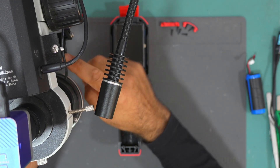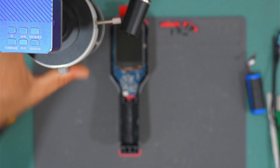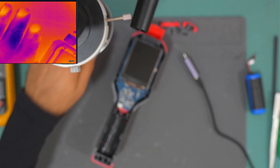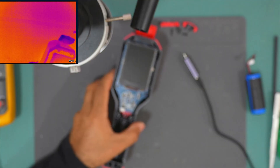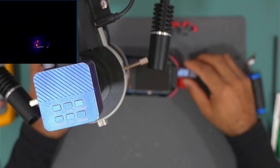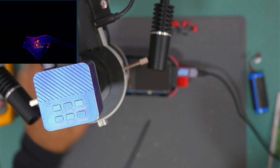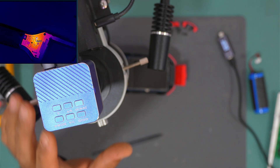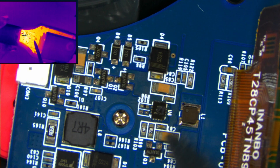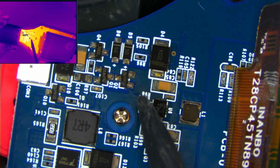I don't know if we can feel the heating component, but fortunately I have another camera mounted on my microscope. I'll inject voltage again using the USB-C. Here is the thermal camera — let's connect the USB-C again. As you can see, we have something heating up down here — this chip. Let me turn on the microscope so you can see. Here is the IC — it's U6. I think the spudger has melted on it while I was pointing to it.